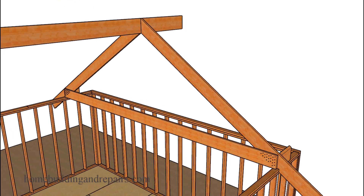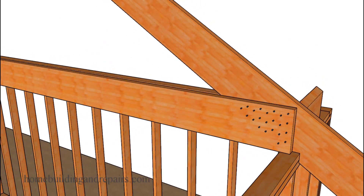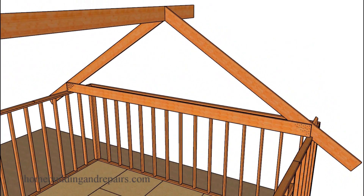That's going to be the amount of nails required per connection. According to one of the charts I found, this could be anywhere between 3 16D common nails and 51 16D common nails. A common nail is larger than a sinker. The more nails you put into a piece of wood, the greater the chances it's going to split, and I really don't know where the thinking is behind something like this.